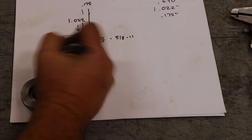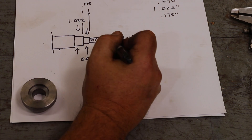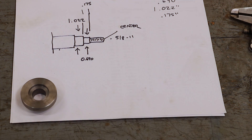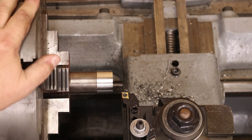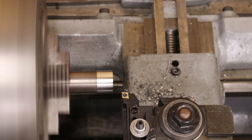The thickness of that step is going to be 0.175. This will mount in my dividing head in the three-jaw chuck. We'll put a center in this end, and that will be held by the foot stock on the dividing head. Let's go make this mandrel and we'll be ready to start cutting some gears. We're set up over here now on the lathe. I have a piece of blank metal in a four-jaw chuck, already indicated in and running true. I'll start removing some metal.